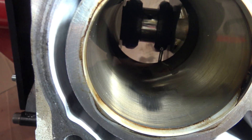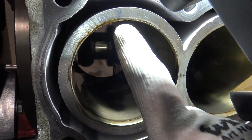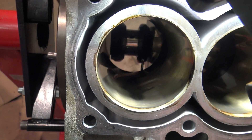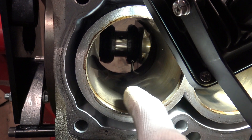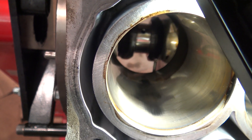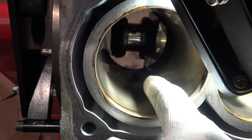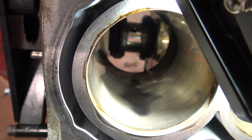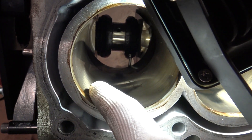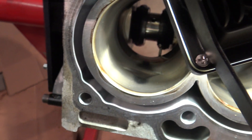Now we can see there are big burn outs — and these burn outs are not only on these sides but in that area too. Here is the rule: if the scratches are very fine and smooth, so that I can't feel any bad scratch — if it is polished and plain — then it is okay. But if we can find any dent or deeper scratch, then it is really bad, because these cylinder tubes must be very fine and smooth. I take my finger in here to check.